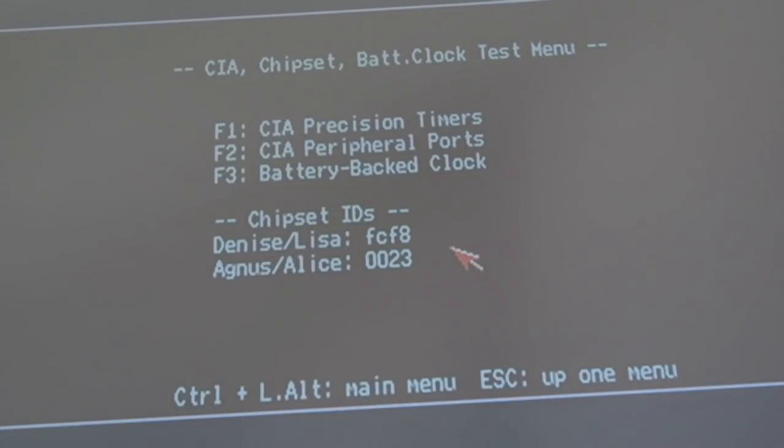So the main thing is we've identified what the cause of that issue was. It is those jumpers. If you've got a problem with the 166s around there, well, the top one relates to your mouse control. So if your mouse is not working, it's going to be that top 166. The middle IC, the bottom 166, is just used for reading those jumpers. And as I said, the first two bits, pins, you know, the A pin and the B pin, should be pulled low, and all the other pins go to the jumper header. In my case here, I've just hardwired them high.